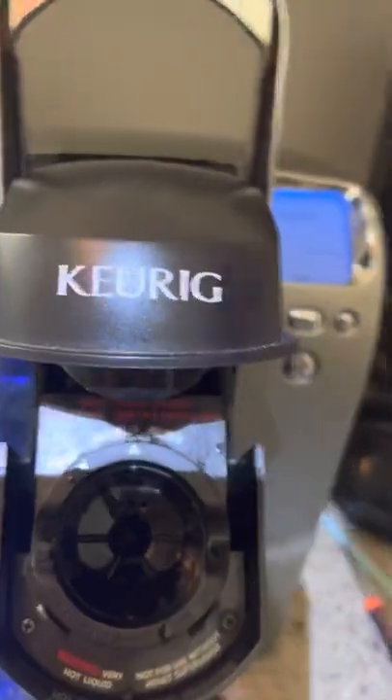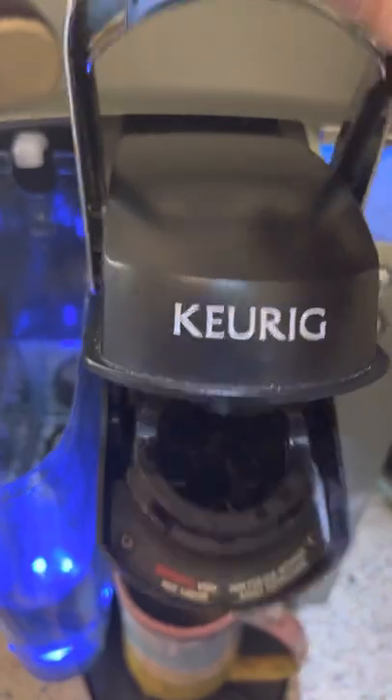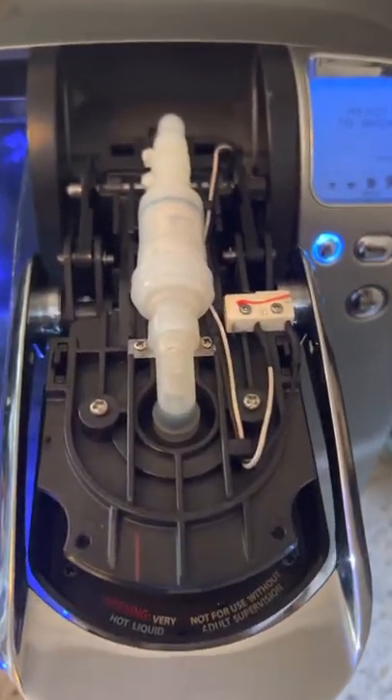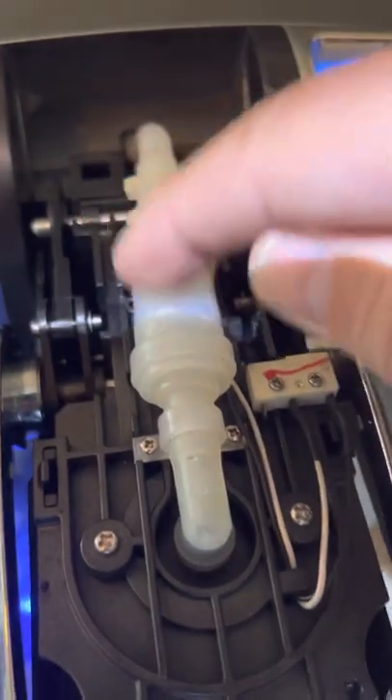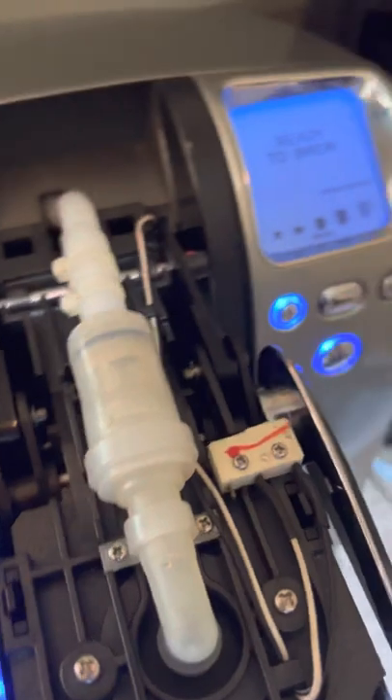So I did stumble upon Apache Ranch's video which tells you how to remove this cover. It's very easy, and there are two screws — you can see the two screw holes up there. I removed the screws and then, following his instructions, you basically just pull forward and up and this thing comes off. That gives you the full mechanism inside, and what he suggested is basically just wiggling this check valve around and loosening some scale that might be in there.